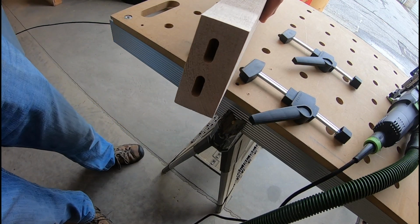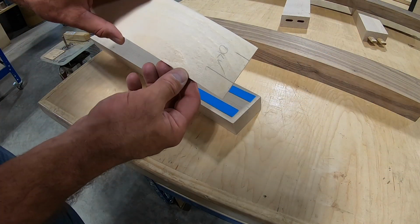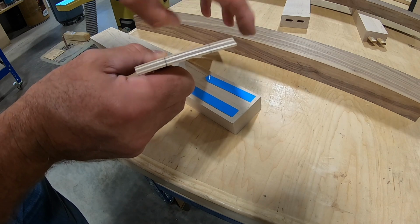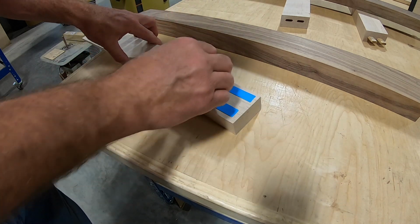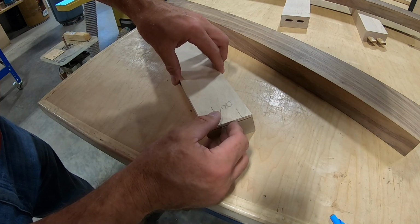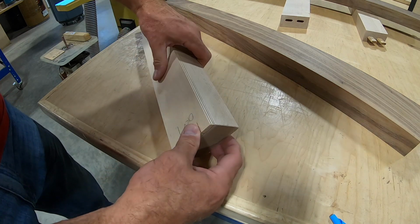That takes care of the long end of the frame assembly, so I move on to the more challenging part on the sides. Using dominoes on two flat surfaces is pretty straightforward, but if you want a reveal, you have to use a shim. It gets even more complicated when you're working with angles and tapers because the shim has to follow the angle of the workpiece.